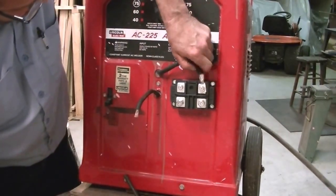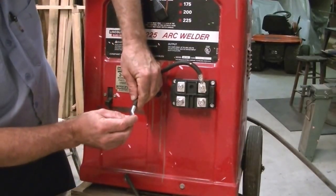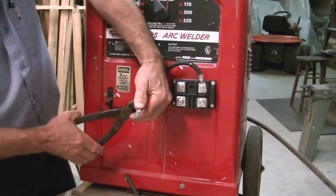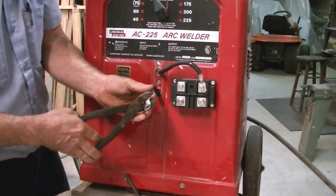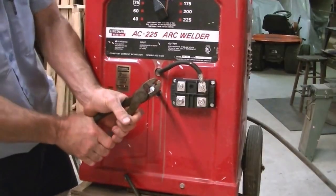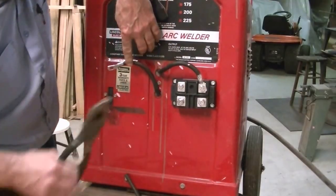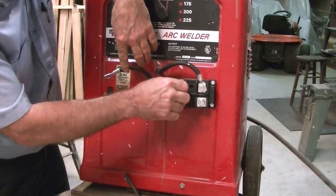We got that one side down — I still have to tighten it. Simply peel back the insulation, slide it on. I'm hoping I'll get results of a good DC machine. I know I still have the same duty cycle, but at least I'll be able to weld stuff like log splitters and tractor implements that are sure enough going to be put to the test, as opposed to having to run 6011 rods and 7014s, which are plenty strong but not a 7018.